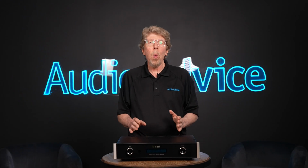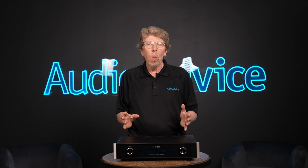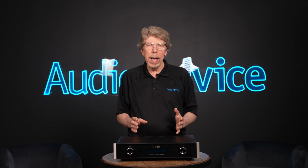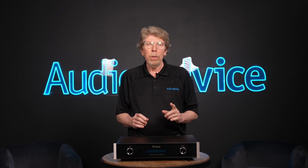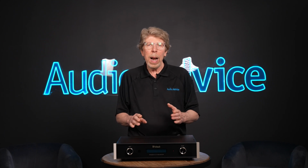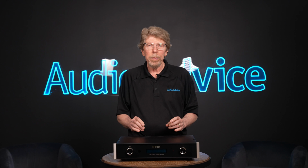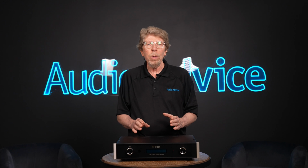McIntosh uses what's called their quad balanced 8-channel 32-bit digital converter DAC. You may wonder why a 2-channel DAC needs 8 channels of DACs. Well, there are 2 big advantages. First, if you parallel 2 DACs, you get a 3 dB improvement in signal noise ratio, but that's just half of it. These are run in a balanced mode where there are 2 in one channel parallel for the positive half of the signal and another 2 in parallel for the negative half. This type of balanced design greatly reduces noise. Once the digital signal is converted to analog, it leaves the DA2 module and passes over to the analog preamp side of the MDA200.